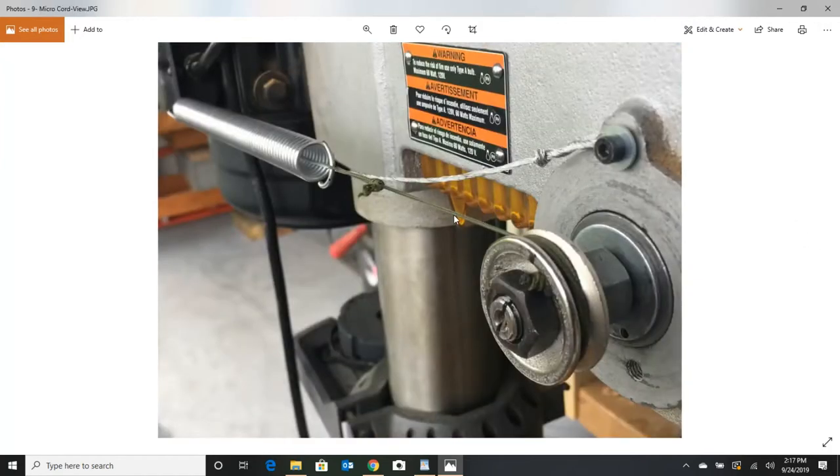Here's the new replacement. I learned this trick from my son. I was at his house in Boston and he showed me a repair he did on a garage spring — he had some fancy paratrooper cord attached to it and explained it was actually stronger than steel. Us old timers do everything in wood, steel, rivets, and bolts, so I didn't believe him. But I did some research and he was absolutely correct. This nano-cord or micro-cord is 1.18mm in diameter with a hundred-pound strength. The beauty of it compared to wire is it's super flexible, so it'll go around this pulley back and forth numerous times without issue, as long as it's not chafing on any nicks or burrs. It's going to last a long time.